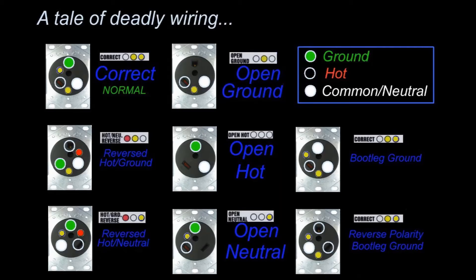If I diagram the most common bad wiring schemes, you can see what the three-light tester is actually doing. In the upper left, power again forms an L. However, if the hot wire is connected to ground or common and is out of position, the two powered legs have rotated and a red light comes on, indicating that there should not be power between the common and ground. As long as all three wires are connected you have two lights, but one will be red. If one of the wires is not connected, there would only be power on one of the pairings, so you only will see one light. If the missing wire is the hot lead, there is no power into that receptacle, and that's why both yellow lights are out — neither side of the L has power.